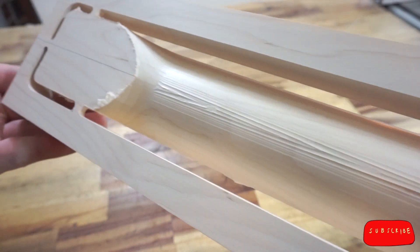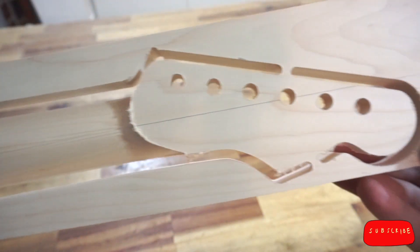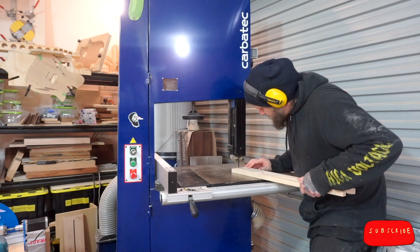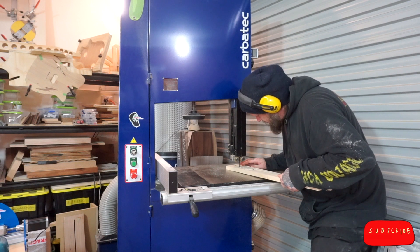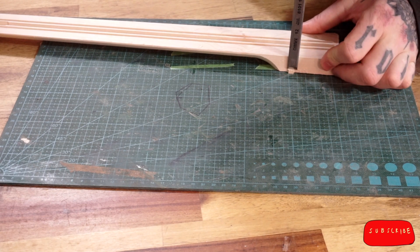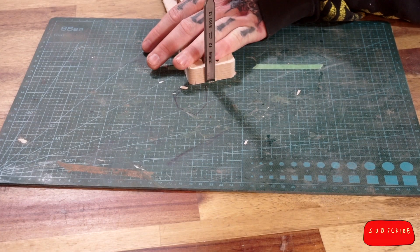Having a look at this neck, we can see that it's a little bit rough along the back, and I did that by choice. As you become more au fait with the process of CAD and CAM design, and also working on the CNC, you're better placed to make allowances for when to take a workpiece off the machine and finish it off by hand, which is what I'm doing here. It is possible to get an almost perfect surface off the CNC, but the trade-off is that you'll be sitting there all day waiting for it to finish. So sometimes it's a good idea to just go with a less intensive toolpath and then clean it up with whatever you use for finishing.